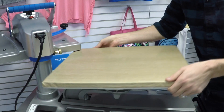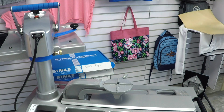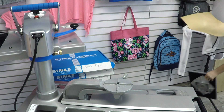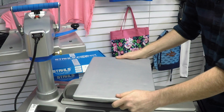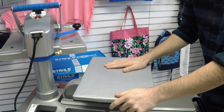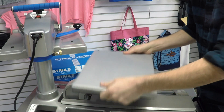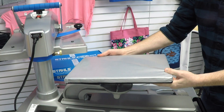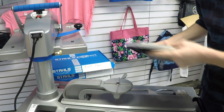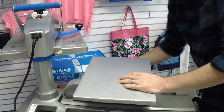One of the great things about this Fusion press is that lightning latch on the bottom — I can just unhook it, set my platen over to the side, and load my 11 by 15. One of the great things about this 11 by 15, which is what makes it one of our best-selling optional platens, is it can be loaded both portrait or landscape on the machine. For this particular design on that hoodie, I'm going to load it landscape and lock it in.